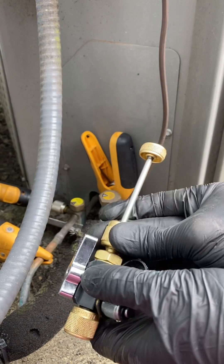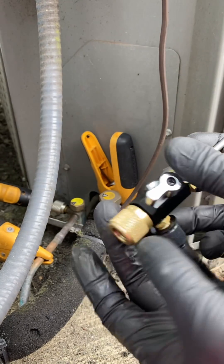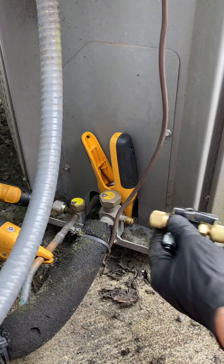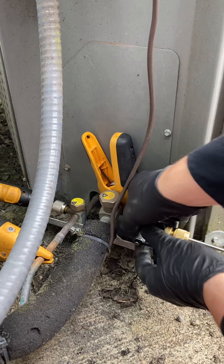Make sure this part is tight and all the way pulled out. This side does have a gasket in there, so I only tighten just enough for the gasket to contact the front of this brass portion. You kind of have to do it by feel.